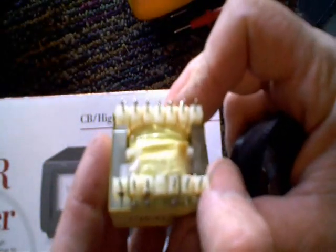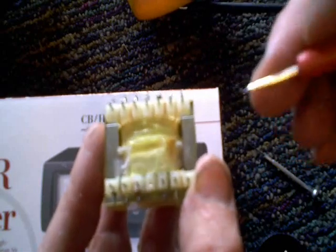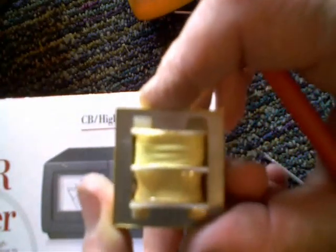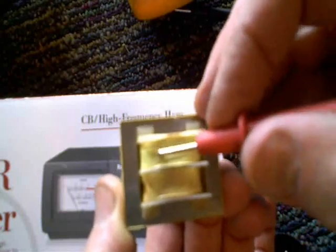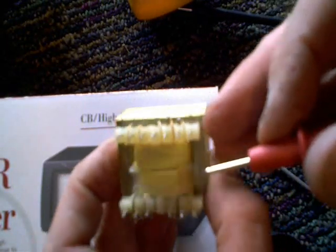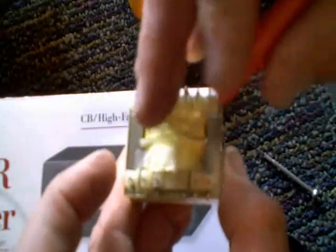Well, unfortunately, when a winding burns out, sometimes that can be a real hassle because it could be deep within the transformer, so you're not going to find it. But a lot of times the manufacturers bury a little fuse inside these transformers, and sometimes it's just a matter of tearing apart some of the plastic covering the wire like I did here. So after I unsoldered this thing, I started tearing apart the plastic, and what do I find? A fuse.